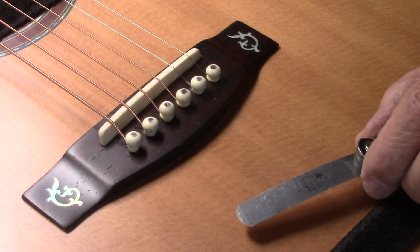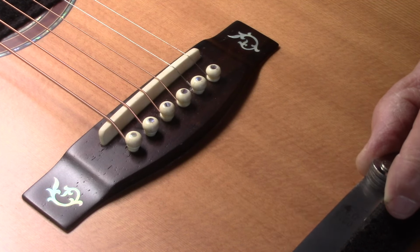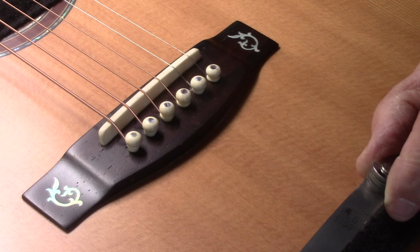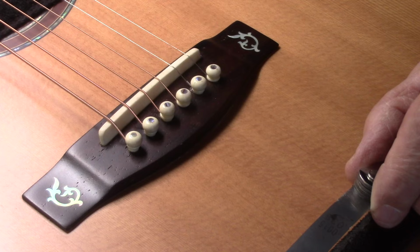This is what happened. You get a spectacular guitar like this, but it's built in Vietnam, which is essentially like a tropical climate. And then it's shipped to Canada and it goes through a dozen winters. This needs a huge amount of correction at that neck to body junction. I'll be walking you through this step by step.